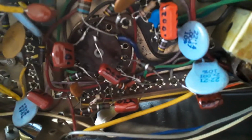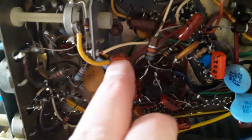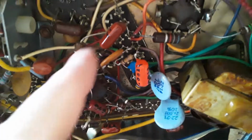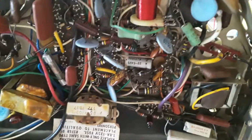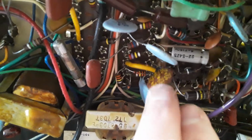Whatever, it's not functioning again, so I'll have to get my capacitor checker. I can just pop each side off of this real easy and check each one. This one here comes from the video amplifier to the cathode of the picture tube, so I'm not worried about that. I think that's one of my better quality capacitors that came from tubesandmore.com. These are right from China, and they don't even have a nice finish on them. This is an old orange drop. These are guaranteed for a couple of lifetimes. I never did any work to the horizontal section, I don't think. Here's one of those couplers that I had to make, only in the vertical, which is right here.